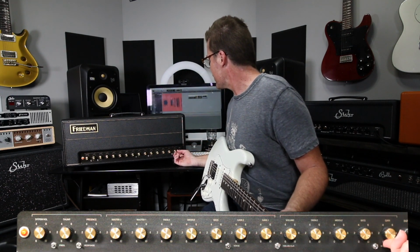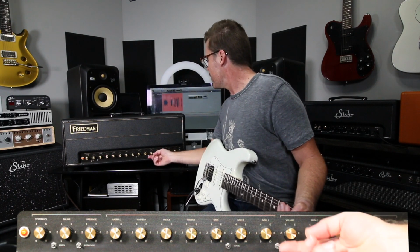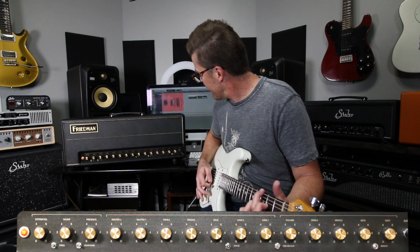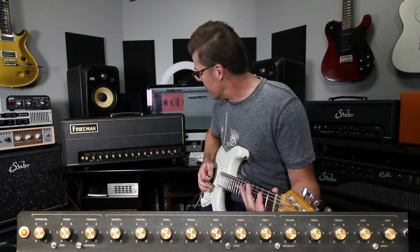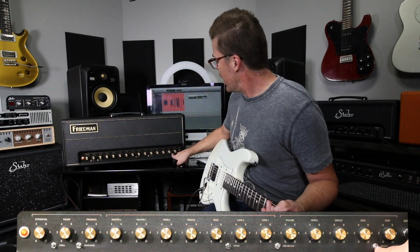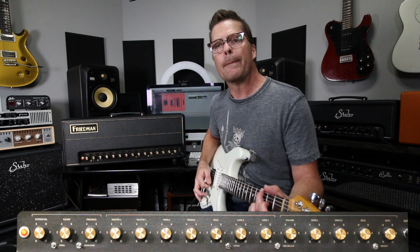Now, if you want this channel to be really clean, we can turn down the gain and turn up the volume. And it's really clean. Now, if we want that to brighten up, you do have a bright switch, and right now it's to the left. What I'm going to do is put it in the neutral position.